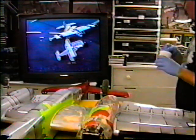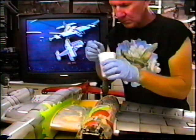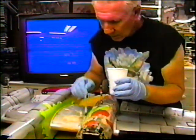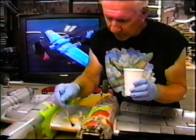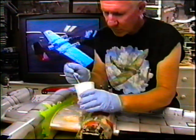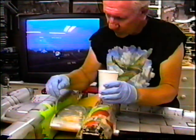We have all the resin worked in. So I'm just going to back-mask everything. I'm going to paint the resin on here, West 105 with the slow hardener. This is going to dry overnight.